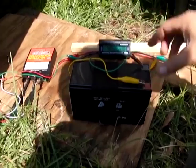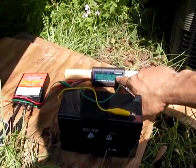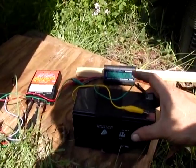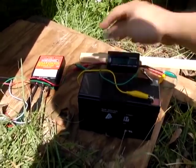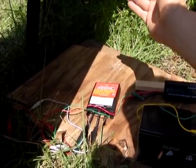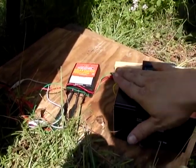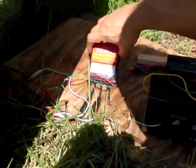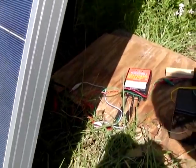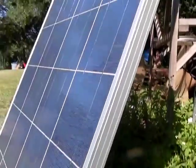As the current flows into the battery, you'll see the voltage start to rise here. When it gets up to around 13 or 14 volts — a little bit above 12 — this solar charge regulator will actually cut off. It'll stop the flow into the battery and keep it from overcharging. You can get this one at Harbor Freight or buy them off the internet too. I'm your host Dan Rojas — thank you for watching and enjoy our videos.